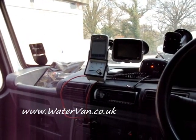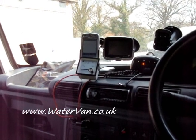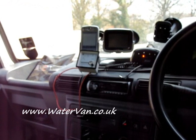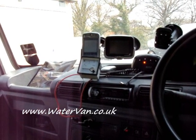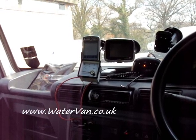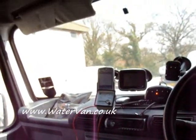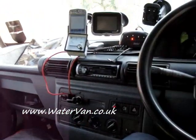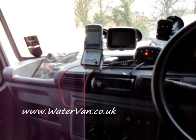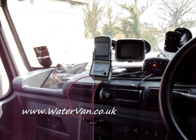I did notice one thing though. As I took it out, I had a look at the bottom of the plates and they're not being held in now in the right place — the spacing is uneven all inside. The outside acrylic is holding together but it's not keeping the plates in the right place. So they're going all over the place. Anyway, I'll put it back in there for now and I'm going to watch the amp meter carefully. If it goes too high then I'll switch it off. But for now it stays as it is, and I'll video the plates for you later.